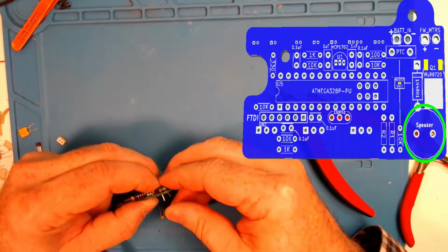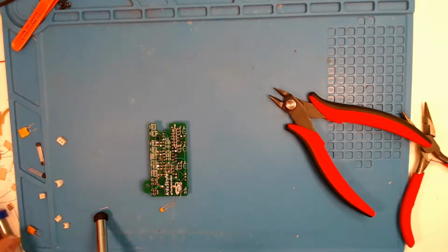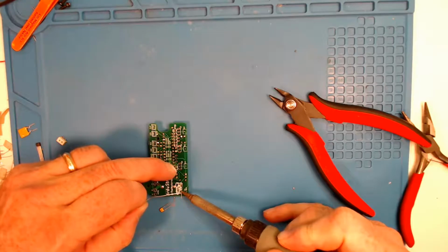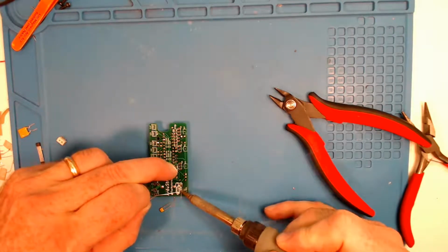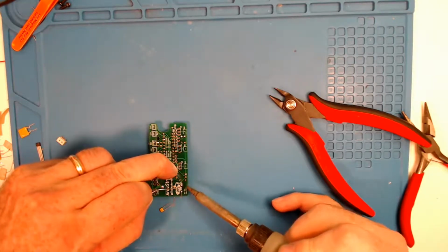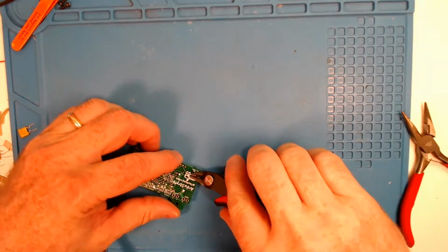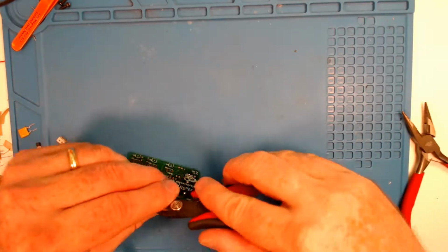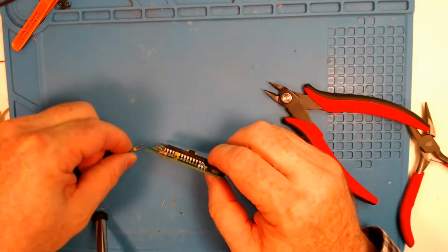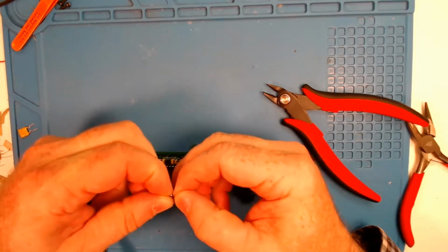This particular piezo speaker doesn't have a polarity. Sometimes they will, depending on the manufacturer. These are from TDK. They're PS1240s, and they don't. I really like them. I use them in soft circuits and some of my other projects, like my TARDIS pin circuit. We're just using it to provide a little bit of audible feedback, like when the system starts up, or if you leave the blaster on, it's going to beep once a minute just to remind you.